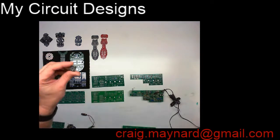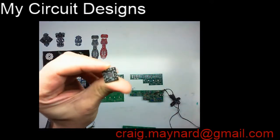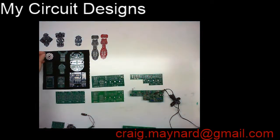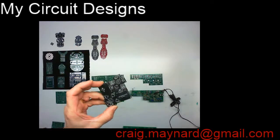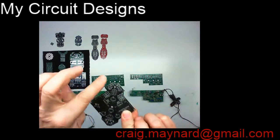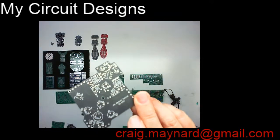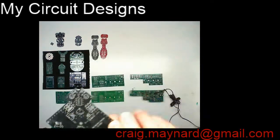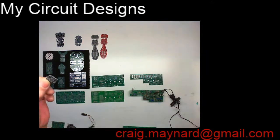The heart of the solar engine is my own circuit design called the Chloroplast. It's a simple circuit with just two semiconductors, a place for a large capacitor, and a place for a solar cell — that's the charge pump. I attached these circuits to a robot kit called the SolarFly-1, which had two glass solar cells, a couple of photocell sensors, and some antenna out front. It was totally solar powered. Because the board had a funny shape, I broke off a few Chloroplast modules and gave them away separately for people wanting to build their own charge pump. I sold thousands of those.